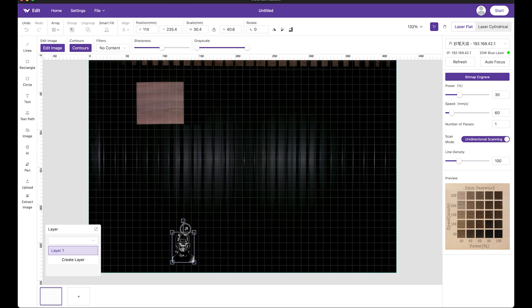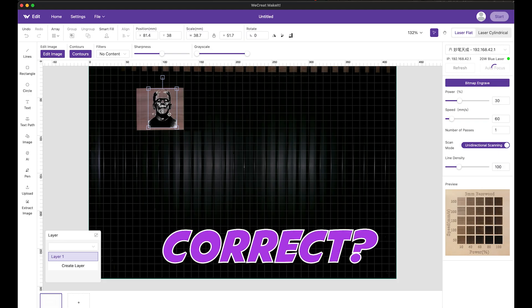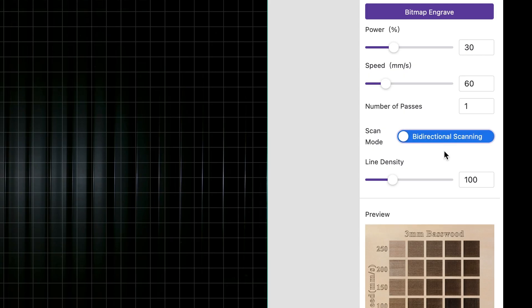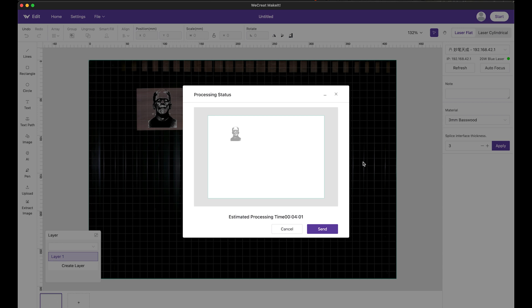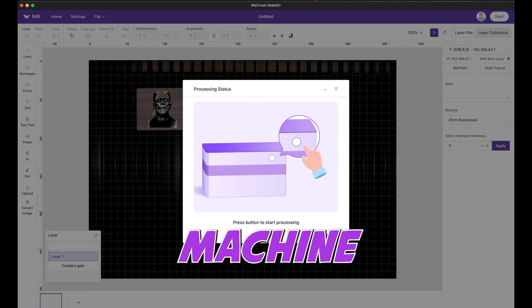So now what I want to do is make this small, and I just have that little chunk that I cut out earlier. So we're going to put this on there. I'm going to refresh — I just want to make sure that piece didn't move at all. Looks good. I'm going to autofocus and let the machine go through its steps. We can say that's a detailed image. So we're going to hit Map Engrave — I'm not changing any of these settings, just what it gave me. I am going to change this to bidirectional scanning, because that's going to go faster. Hit start — it says it's going to be about four minutes. Then if I hit send, it's going to tell me I have to hit the button to start the engrave. Let's hop over to the machine now and check it out.